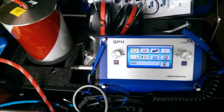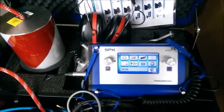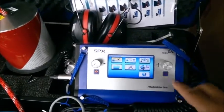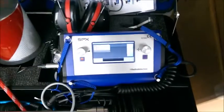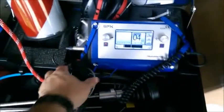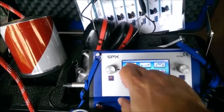The touch screen window option lets you deactivate or reactivate the touch screen, and calibrate it if it's having trouble recognizing your fingertips. You can also clear memory using that option. Exiting out of settings returns us to the main menu. Let's take a look at the acoustic measurement option — the first one. The unit has the noise cancelling ground microphone and headphones plugged in, so it automatically went to acoustic listening when powered on. If you aren't in that mode, you can reach it from the top left of the main menu.